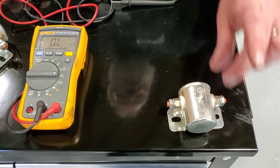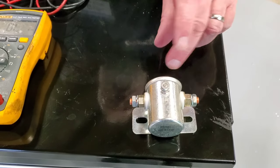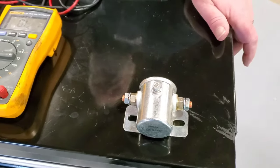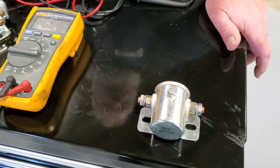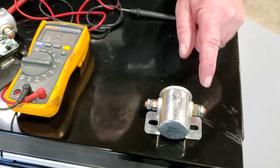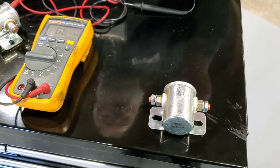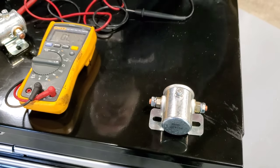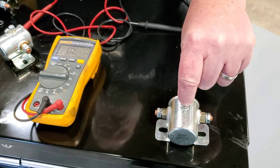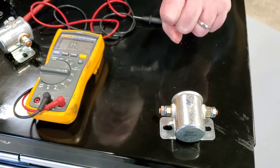Again, battery would have to come in on one side. This terminal needs to see ground. One of the applications that this is very common with outside of our industry is on hydraulic tailgates, where a hydraulic tailgate will bring the B plus into here, run that down to the shot terminal on the motor, have an arm that operates up, lowers and raises the hydraulic bed, will bring this to ground, raise the deck, and then manually lower it.